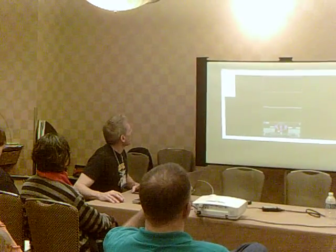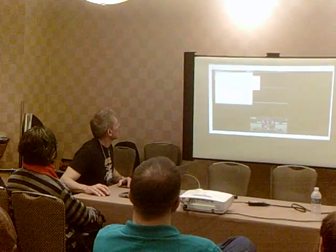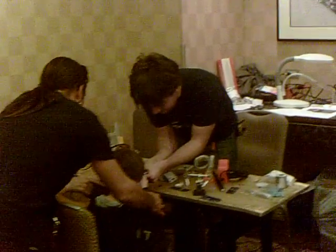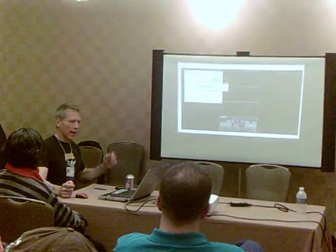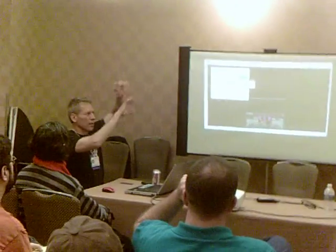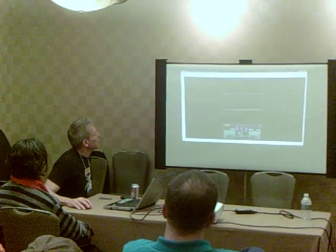I'll just do my manual process. Usually this goes really fast. Sometimes when you put the ground plane on, there'll be a line on the edge that you don't see, and that causes it to try to generate all these weird polygons — thousands or tens of thousands of them — which takes a long time to process. So I'm going to cancel it out for now, because I've already got Gerber files sitting out there.